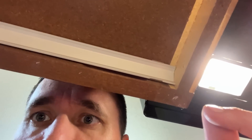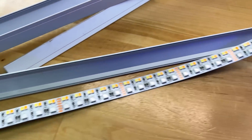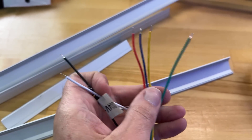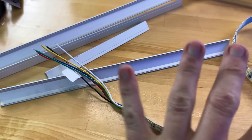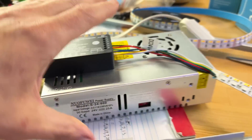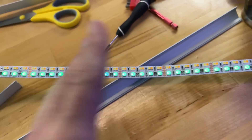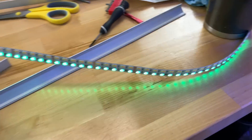Got all the channels installed with better screws — snapped the diffuser in, you can see it under the cabinet. The previous dangling LEDs were just my fourth iteration of testing. I ended up getting these new RGB CW strips — super bright, with a Zigbee controller, they take six wires. I'm going to use these for both the kitchen under-cabinet lighting and landscape lighting. Already ordered more. They have a sticky back and can be cut every two or three inches. Still waiting on cable to run things properly, but here's a quick demo of the Zigbee controller.